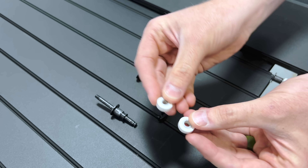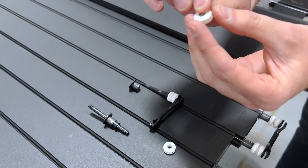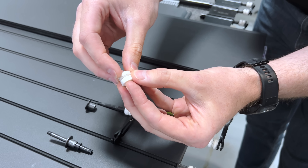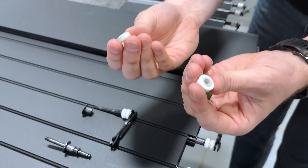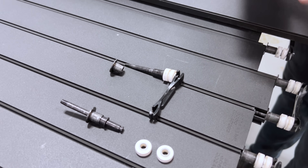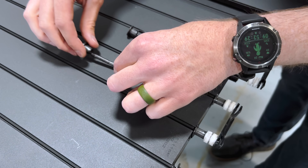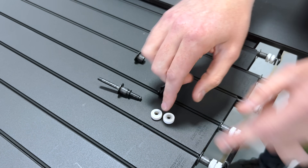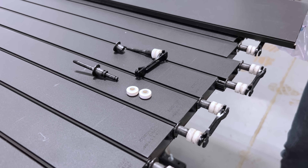You could probably put 100 of these in a cavity offset where the tool closes — you wouldn't have a part line. If done as one piece there'd be a lot of tool complexity and part lines on bearing surfaces, so it makes sense to see these as two separate pieces. You can see on every one of these legs there's a kind of bearing, two rollers, and a dog leg connecting them, and this goes throughout.